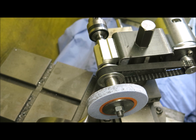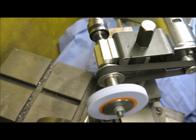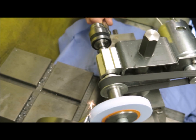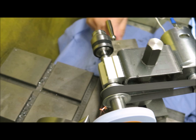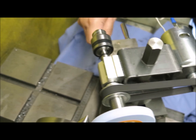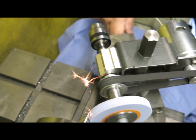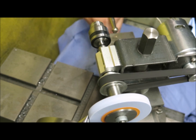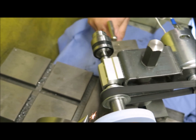I'll just start it up and let you see it grind up this centre. You can just see it licking up the centre, taking all the grooves out, making it good for use. In the days before they had running centres, this is a job they used to do regularly — most lathes came with their own tool post grinder of some sort or other. Just let the sparks clear out so you've got a nice clean face. There we go, job done.